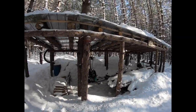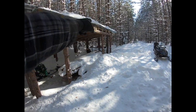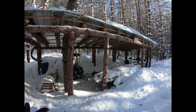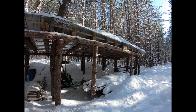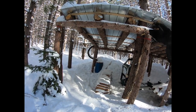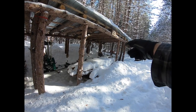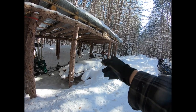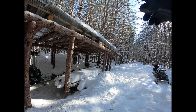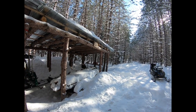I got two really long red pine trees - you can see the horizontal ones - those are the ones supporting the rafters, essentially makeshift rafters. One thing I keep in mind is the span: I don't have a huge span right now between the two posts you see at the front of the setup. The reason being is with a snow load up on that roof, it's going to be putting a lot of pressure on that horizontal piece.